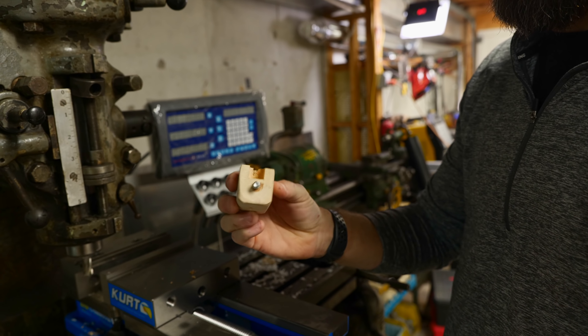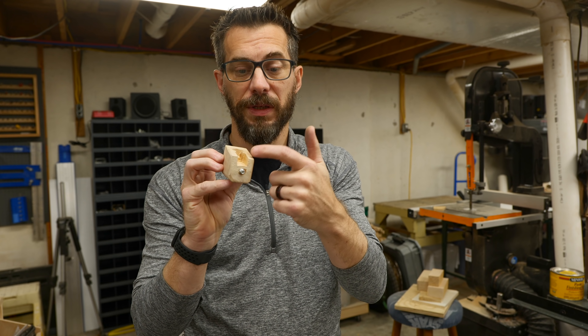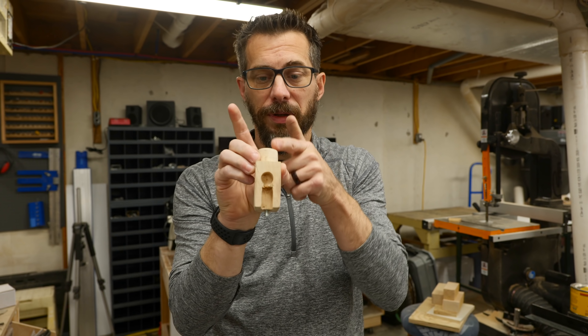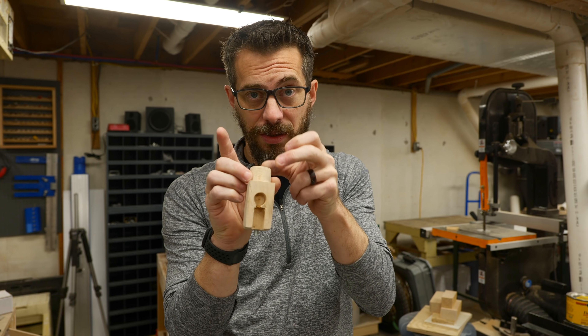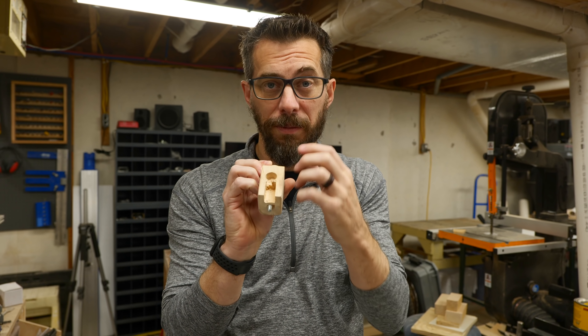It's great when you use the right tool for the right job. What I think we can actually do is take this half inch piece of aluminum and make this same thing only a half inch thick. That means the plug that goes up into the pipe is only going to be a half inch thick, so we'll have to use some set screws to keep it from spinning in the tube. The hole for the spring is going to be captive within the piece of aluminum but the spring will stick out on the sides a little bit. We can make this entire mechanism one piece so it can't bend or break with the tension of that spring. This is going to take me to the mill to do something I have never done before, so you get to watch me learn.